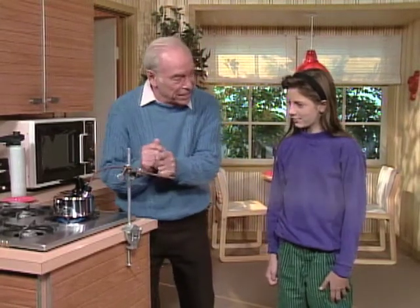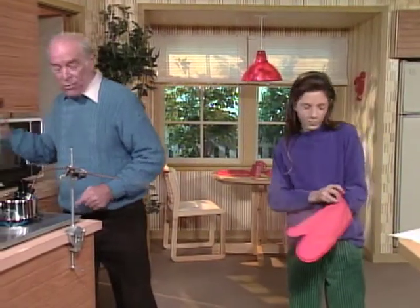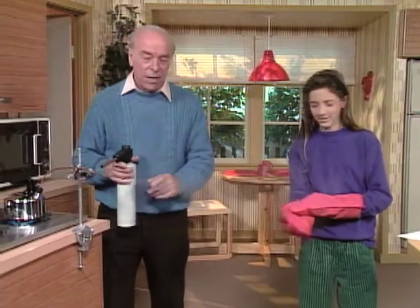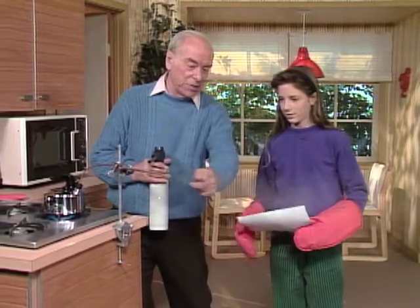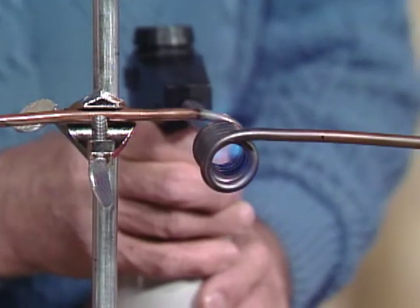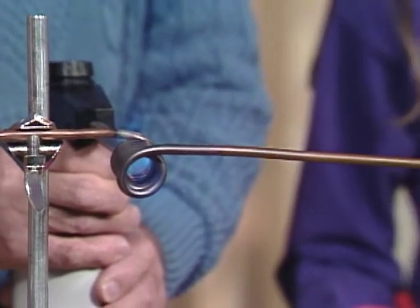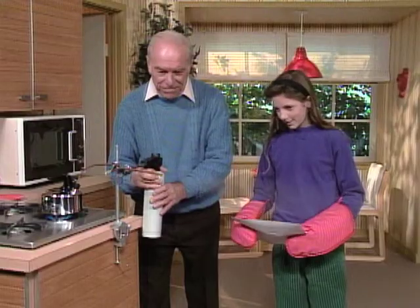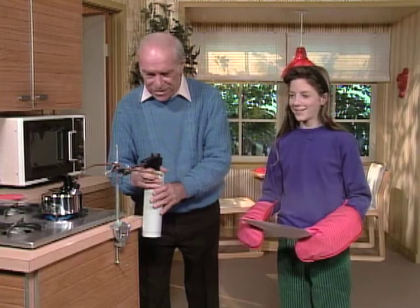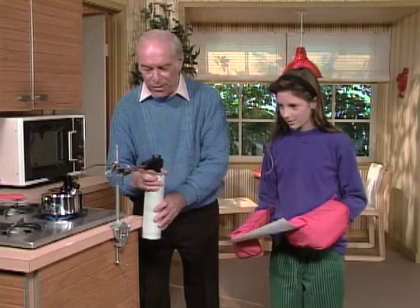Why at the coils? Well, the coils are there so that you can make sure you get a good supply of heat to heat the steam — so there's more surface area. Get set with the gloves and get ready to bring the paper over as soon as you see a good supply of steam. This is going to be an invisible section out here. Watch — nothing's happening yet. Give the torch a chance. It's getting a little bit more right now. There's lots and lots of steam — the water vapor is way out here, so all this section is superheated steam.